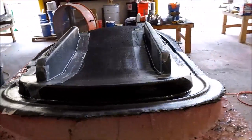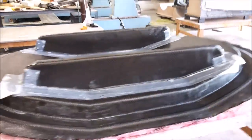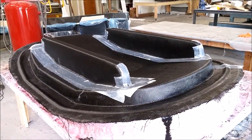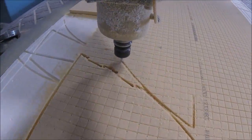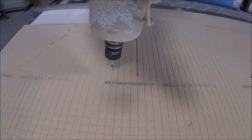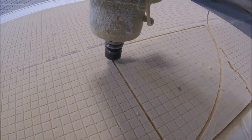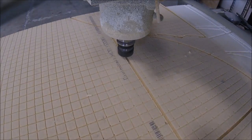Welcome back. When we last left off I wanted to show you how we put the braces on the mold for the aft bulkhead. Here you can see they were basically put on there at the end when we finished laying it up, with a little bit of peel ply. The next thing we had to do was cut some core out for that part, because that whole bulkhead has different variations of core in there, and some hard points as well for where the landing gear bolts into it.